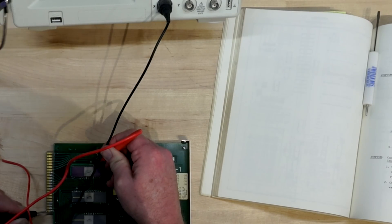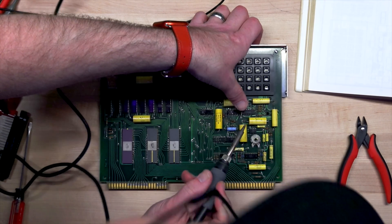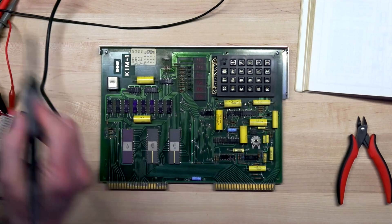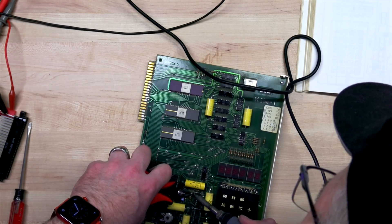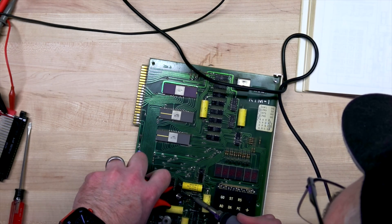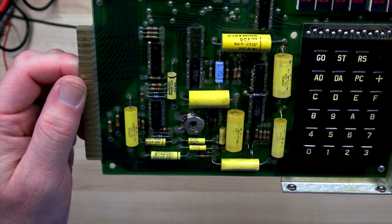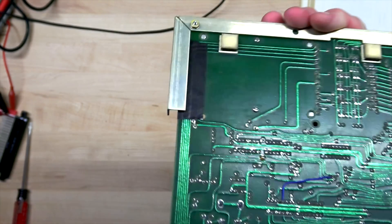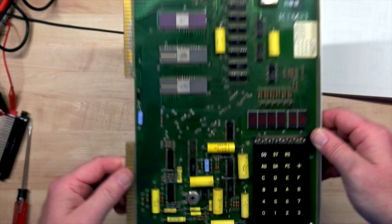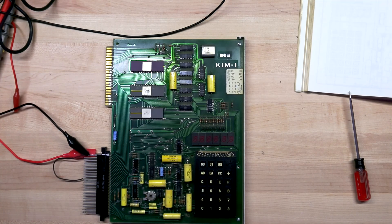Scopes are nice, but I want to check the voltages again with my old Fluke meter and make sure it's working properly — which it seems to be, until I left my screwdriver lying across it. I want to correct the Zener diode here that was moved, and there's a resistor right next to it that was also relocated. I'm going to put them back in their original position based on the schematic, photos, and other information I have — because I've got a feeling that if TTY is enabled, perhaps the keypad on the front does not work. With those two or three things fixed, that was the Zener I moved, and that nearest resistor is the one that was previously unhooked from its original pad. There's also what Adrian would call a bodge wire — I'll see where it actually hooks up and if any other KIMs have it. For now I'm trying to do one thing at a time.